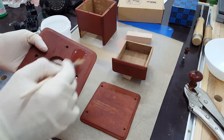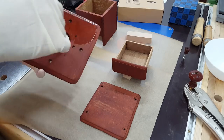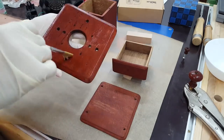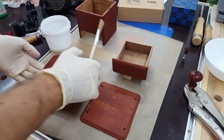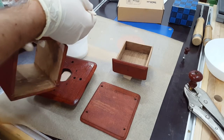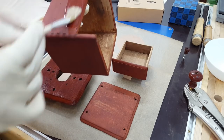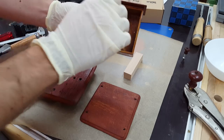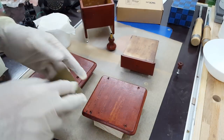To seal the surface, I used a clear, semi-gloss acrylic lacquer. And to completely protect all parts from moisture, I painted every surface, inside and out. Since the lacquer would now come in direct contact with the ground coffee powder, I chose one that stated to be safe for use on baby toys, aka safe to be chewed on. In addition to that, it is alcohol and sweat resistant, so it can be thoroughly cleaned and disinfected if wanted.